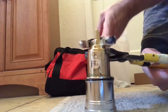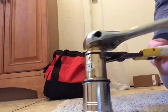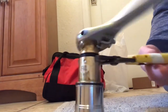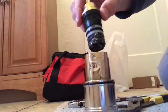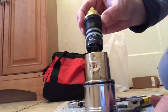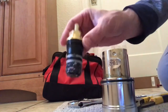You put a little muscle into it and it will come out. Keep turning and eventually the cartridge will come out. This is the cartridge for the Hans Grohe TB2 — the part number I believe ends in 86,000. Notice it's gray and shorter; the TB1 will be longer.